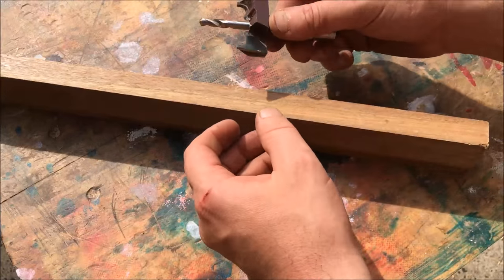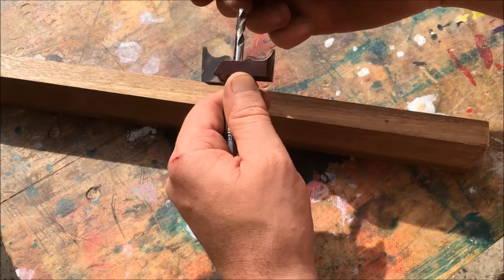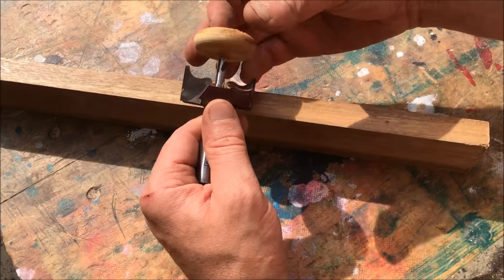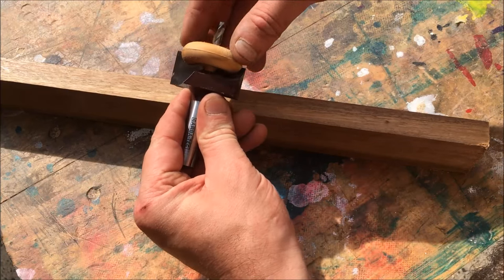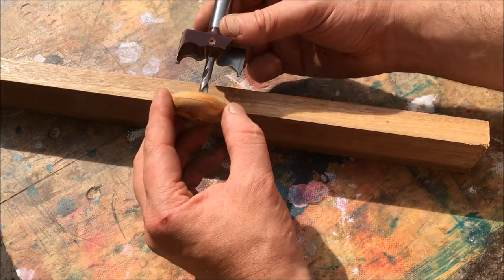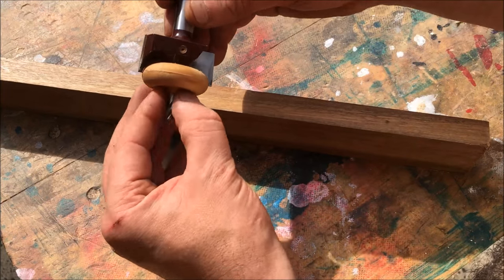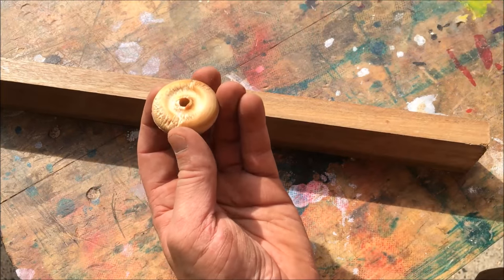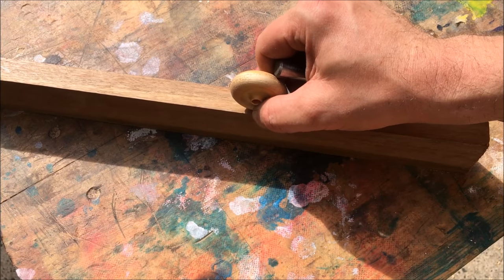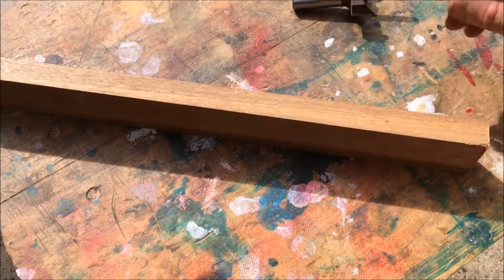But the problem with that is you're going to get torn-up edges. The reason is in the center there's sort of no cutting part. So you come in one side and drill it just until you touch the edge — and the wheel fits exactly snugly, there's no more room for the hub to go up. When you come on the other side, if your wood is not the exact thickness of the wheel, you're going to start ripping up the hub and smashing your ends. Making the wood the exact thickness is one solution but it's fairly hard to do and not practical. It requires precision on both sides and doesn't eliminate the problem of no gap for wood chips to escape.